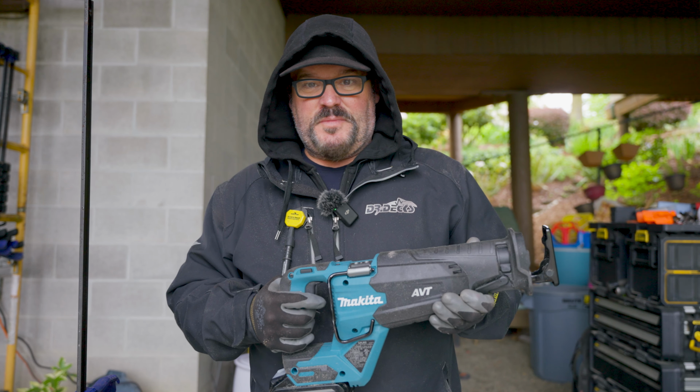So a couple of features on this saw: it has a speed control, which usually I just leave all the way up, because there's also a speed control in the finger of the saw as well. Unless you really want to go slow for some reason, maybe you're starting a cut in metal or doing a specific cut and you don't want to overheat the blade, you could definitely go slow. And then you have adjustable speed on your trigger, right? But for wood, usually we hammer on that baby.